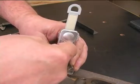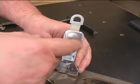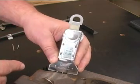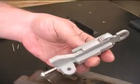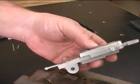With the depth gauge on a flat surface next to the hole, we push 0 to set that surface as the starting point. Then slide the gauge over so the plunger falls into the hole, and then push the hold button to freeze that setting. And then you can pull the gauge out and clearly read the dimensions. The snap gauge also has a mounting lug on the back so you can use it like a dial indicator.